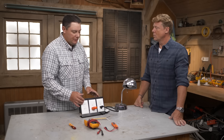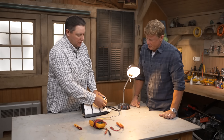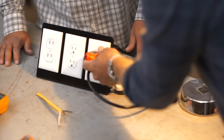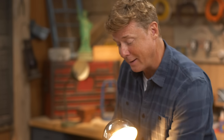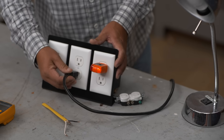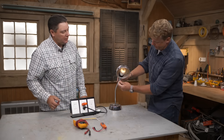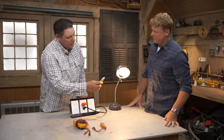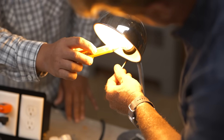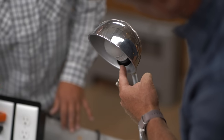Why do I care if it still works? Because it's a safety hazard. You'd think you plug something in, it operates — what's the difference? Say you had this metal desk lamp. We've got a bulb, we turn it on, we're working. This particular outlet is wired correctly — the tester shows correct. The hot wire is correct, the neutral is correct, the ground is correct. But if it was backwards — this is the one we've indicated has reverse polarity — it's still working, on and off, no problem. But we can show that even with the switch off, we still have power up at the bulb. That's still energized. That's the problem.